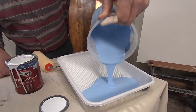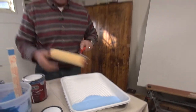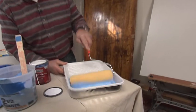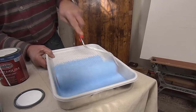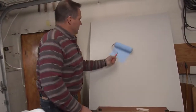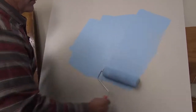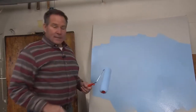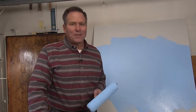Not bad. Again, most paint stores and hardware stores will do this for you, but I'm just showing you the trick on how you can do it. Load up that roller — this is just your primer. Now start priming. Put that primer on — it actually looks pretty good — and really make it nice and even. When you put that dark color over the tinted primer, you're going to have a great looking paint job.